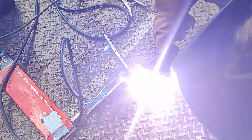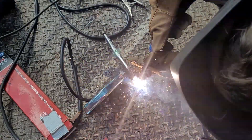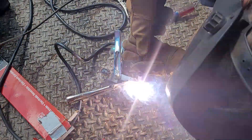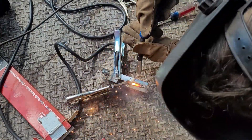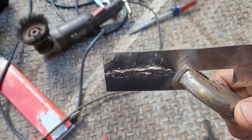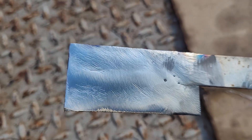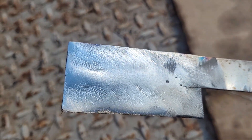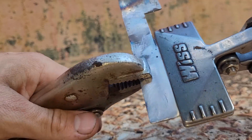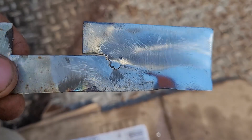Let's try welding some thin metal. Not too bad for flux core. Not bad at all guys — you can see that one little speck right there, I didn't really weld it that well, but it cleaned up nicely and got good penetration all the way through. The MIG is really good on this. Nice solid weld — the metal broke before the weld did.